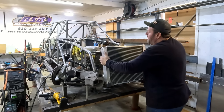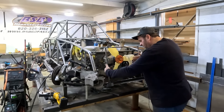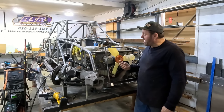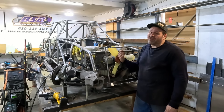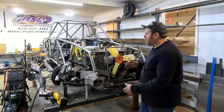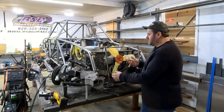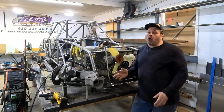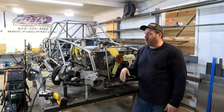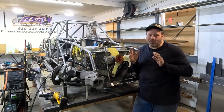Those little quarter-inch rods will be fine for the struts because all I'm trying to do is just keep that from wiggling. Radiator just sits in there. I'm thinking inner tubes down here, but I might do silicone and some saran wrap — that'll make sense when I do it. However we do it, we'll show that when we're doing the assembly. I may not even bother with a fan shroud at this point because last year I was running features dead-hot summer and hitting 170. Total time of me doing this: one hour from start to finish. Don't put a bunch of time and effort into radiator mounts — you're just going to tear it up. That's just the reality of stock car racing.